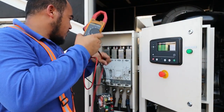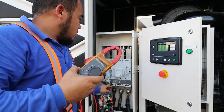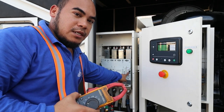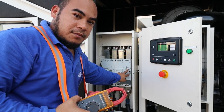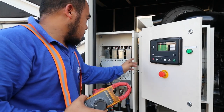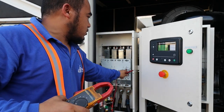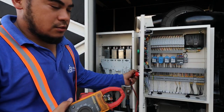For example, with our breaker closed, I'm going to turn it on. This auxiliary contact has normally closed and normally open contacts. We are using the normally open. Once the breaker is on, the contacts inside will become closed and it will give feedback to your module. Supposedly, if it is closed it will give supply for your relay.